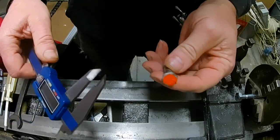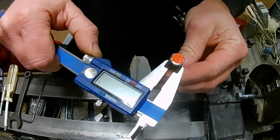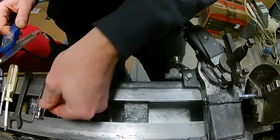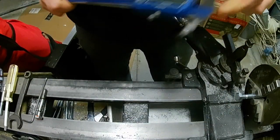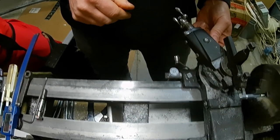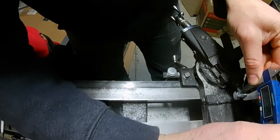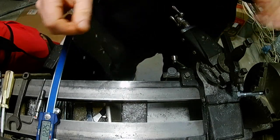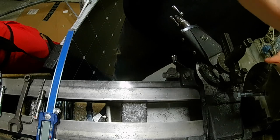The other really important part is your relief depth. The relief depth on the original part is about 0.23 inches. What you're doing is taking this 5/16-inch bolt and making it weak in two spots — taking the strength out of it — so you want to make sure that strength value is the same on the new ones. We got 0.22 to 0.25, so we're pretty close. Now we'll pull this out a little and do the next relief.